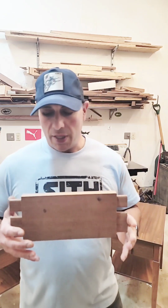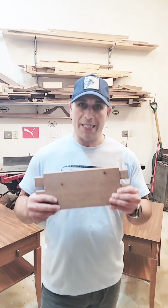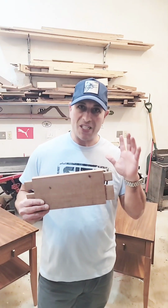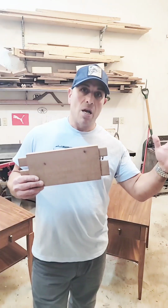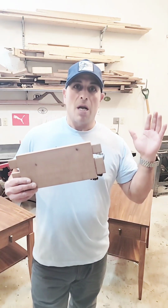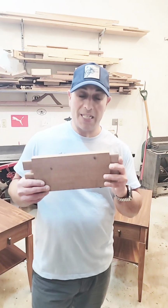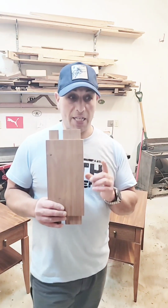This material I get from a company called Richie Lou, and they're out of Buffalo. They are fantastic. It is Sapele, a subspecies of mahogany, and mahogany is all about, in my opinion, I love the dark stuff, so that's what I specifically look for. And in mahogany, it's a crapshoot. A lot of times you'll get Honduran or Philippine mahoganies, which is very light, and I'm looking for African mahogany, and that's even hard to get in dark the way it was a long time ago. But this material is very consistent, and it is dark like that African mahogany, except the difference is it's very straight grained, and that's what I love about it.